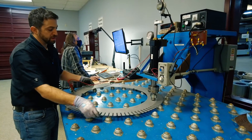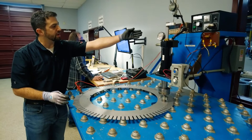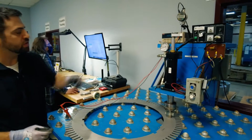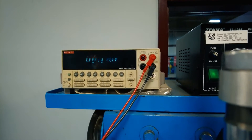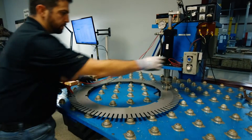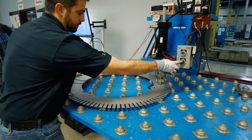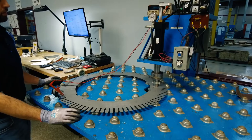We'll take multiple readings all throughout a part and verify that we have high — or even beyond the range of the tester — in terms of resistance. Our ohm meter will max out at 100 mega ohm, so what we're getting is beyond 100 mega ohm in terms of resistance value.